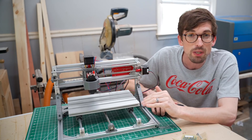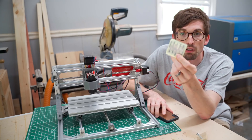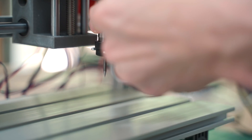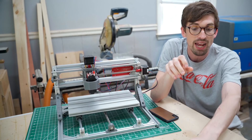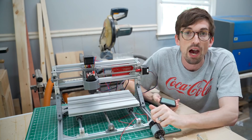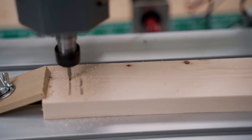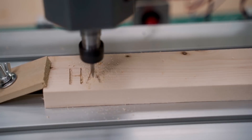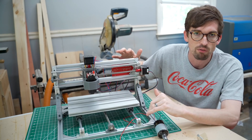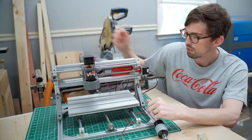Let's get into some of the drawbacks for the machine. If you want to do engravings on small cutting boards or cup holders, this thing can do that. You can put in a bunch of different bits — they provide you with several of the exact same bit, a V-carve bit that's one flute, so they're going to wear out pretty quickly. But you can use third-party bits from Inventables or Tools Today. This collet takes 1/8-inch bits. Another thing to keep in mind is your total Z-axis range is not a ton once you get the bit in there. One big thing larger CNCs have that this doesn't is limit switches — without them, it can run into the ends and eventually wear out the motors.